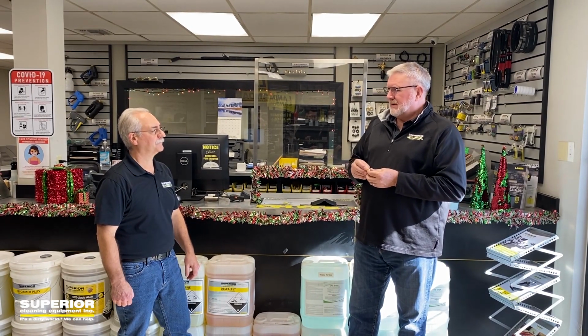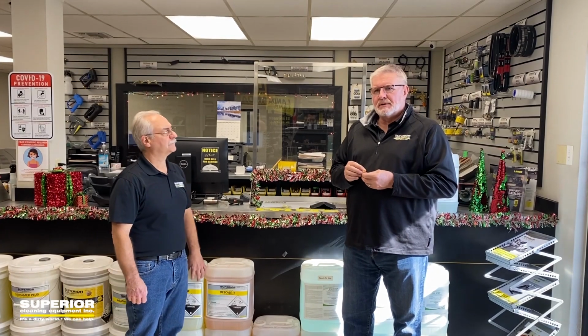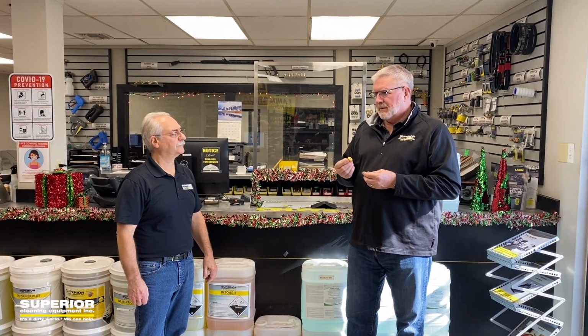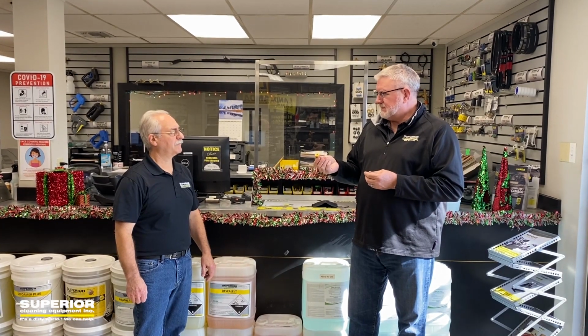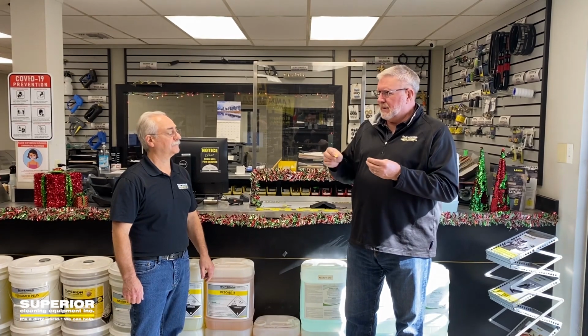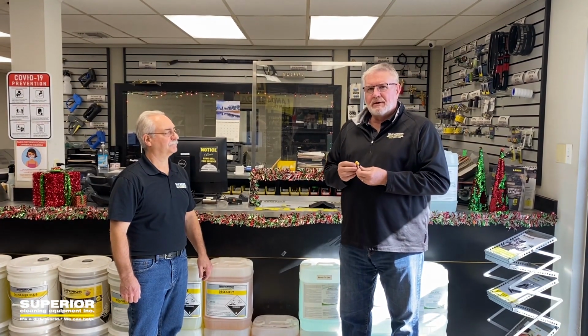Exactly. Kind of what we talked about in another video, which we'll be doing, and I did a podcast on, which is nozzle down troubleshooting. Why it's important to start with something small like this. And how much is a nozzle usually? What does it cost? $7.50. Yeah, $7.50. Before you get into the unloader, the pumps, the valves, all that stuff, replace your nozzle, right? Okay, good. Thank you, Ralph.